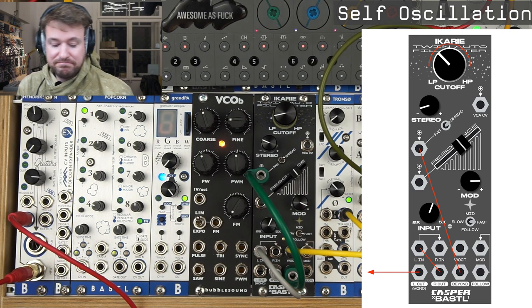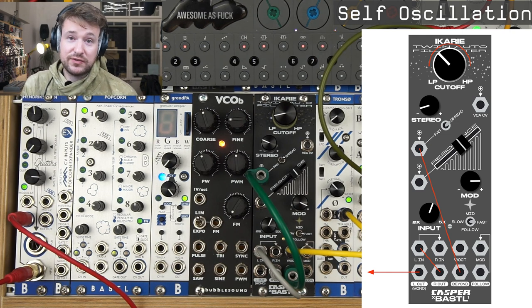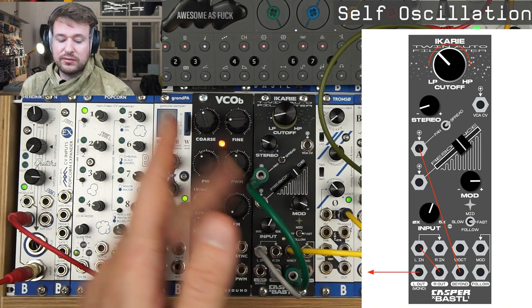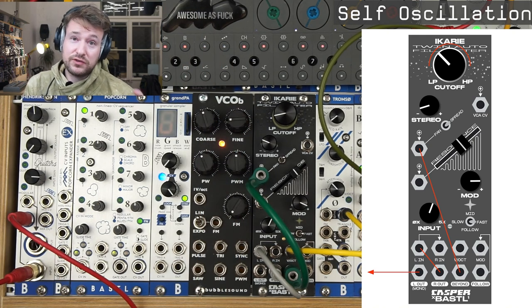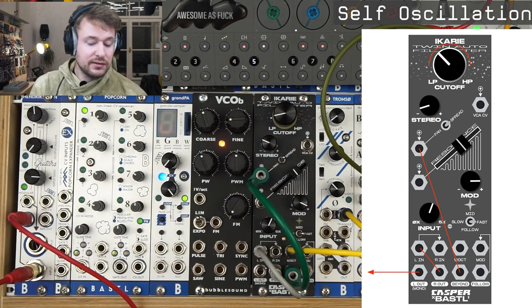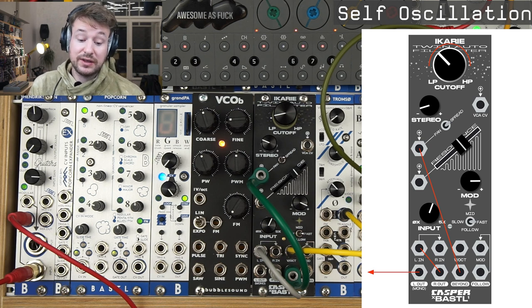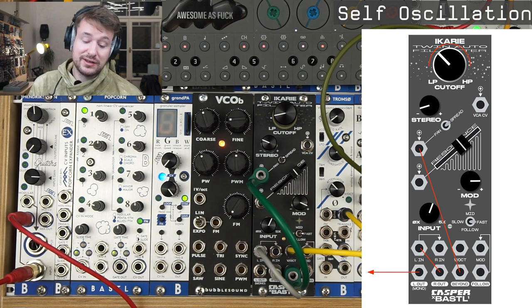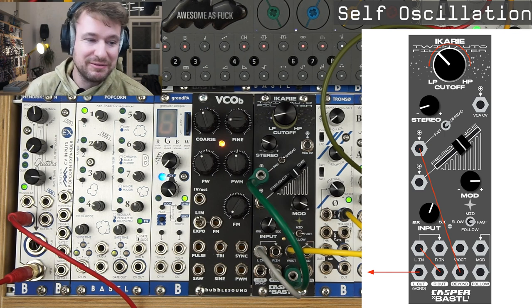Okay, so I was just tweaking knobs, not really knowing what to expect, but as soon as you do something like that, a heavy feedback system that influences itself, also with the voltage, you get a lot of chaotic behavior. There was this sort of white noise territory at the end of the high pass mode. There are a lot of different sounds you can get this way. And then of course you can use an LFO and modulate it, which I did later, to get even some strange rhythms with the analog chaos computer, to call it that way.